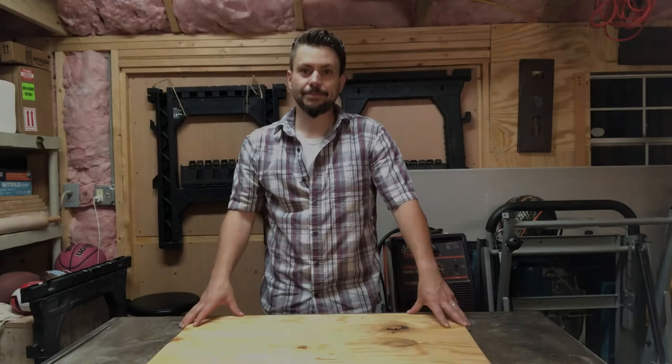Welcome to the studio. Today we're going to be talking about etching steel, aluminum, and zinc-based metals using a chemical etch. This solution is relatively easy to mix up — it only contains two ingredients besides water, and it's relatively non-toxic. Most chemical etches we're familiar with use things like ferric nitrate and other harsh substances that are bad for the environment, make a mess in the studio, and are hazardous to our health. What I'm going to show you today cuts down on the toxicity.